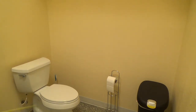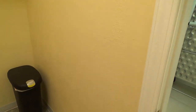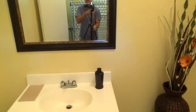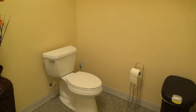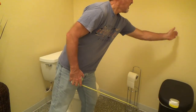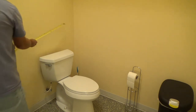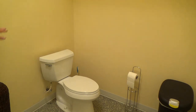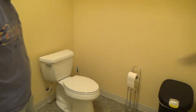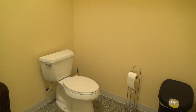The paneling only has to come up 48 inches from the ground on the side wall and back wall behind the toilet — you don't have to wrap paneling all the way around the bathroom. You don't have to do behind the sink wall or behind the door. Check your local ADA requirements. Marlite paneling or FRP — fiberglass reinforced paneling — comes in four-by-eight sheets, is considered washable per code, and you glue it to the wall.